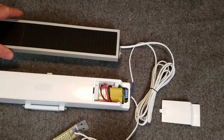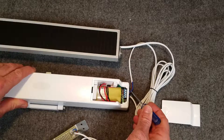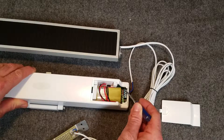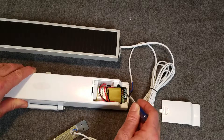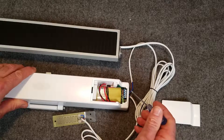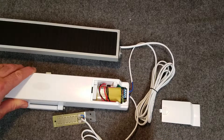The solar panel is polarity dependent — blue is positive, brown is negative. Blue must be in the first, topmost location here, followed by the brown in the second. The rain sensor is not polarity dependent, but I like to wire them blue, brown, blue, brown just to be consistent.